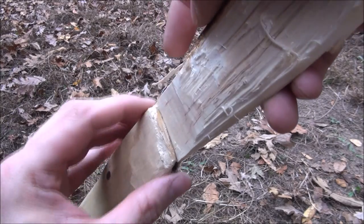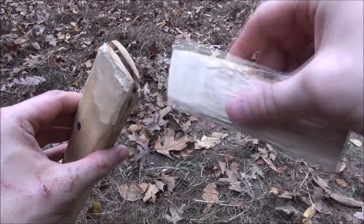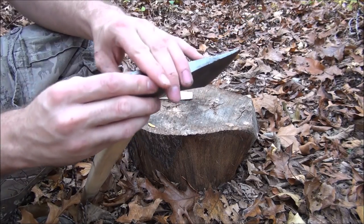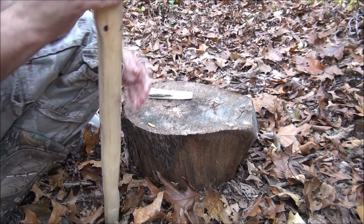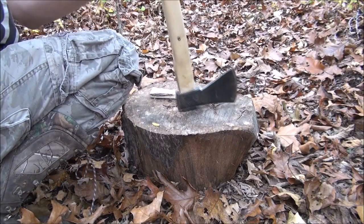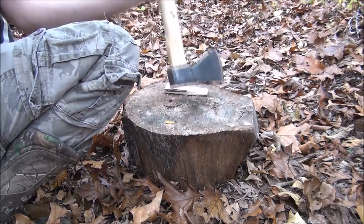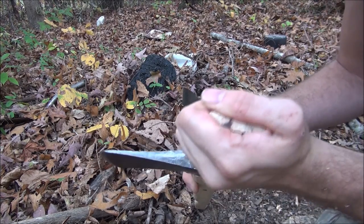Nothing hanging off the sides or anything like that — it's a pretty good fit. But first we're gonna take our axe head and put it on first, then we're gonna hammer our wedge in. We're gonna take this axe head, just put it right down on your axe handle. We're gonna take our wedge — remember it's fire hardened just like the handle is — and put it right there where we cut with our saw.